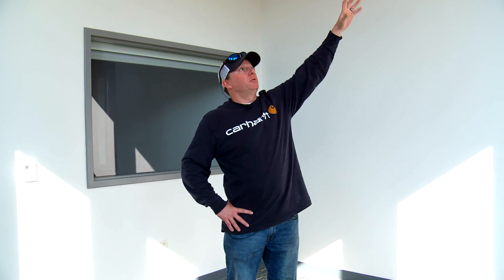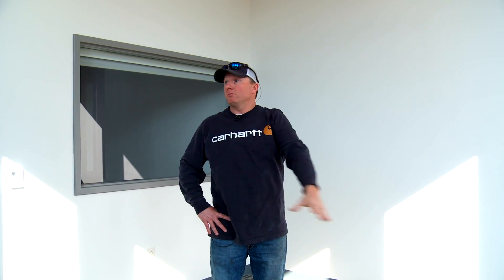We're on the second floor, southeast corner, looking at the fire protection here. The main control valve is above the ceiling — it's the same as the one on the first floor. If there's a problem, you isolate the floor so you have fire protection on the rest of the building, and you drain the system right here. Each valve has its own drain.